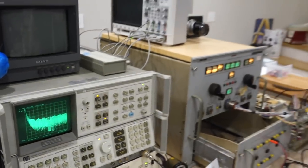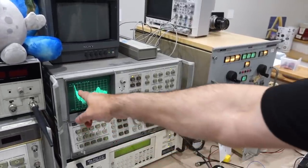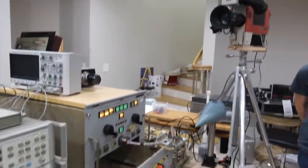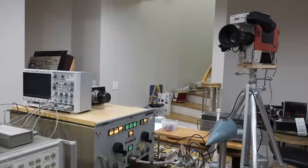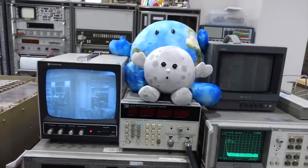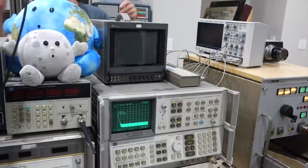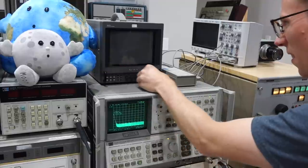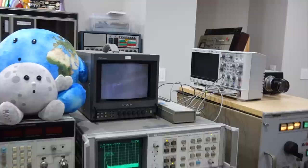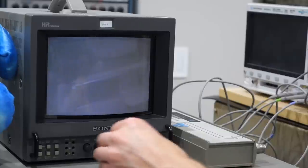Right now, this is the black and white from our camera, and most of the signal is below one megahertz. But with the color camera hooked up, we now have color. In regular NTSC, the color subcarrier is at about 3.58 MHz — so let's hook it up. I don't have any hopes; we'll probably get a black and white picture but won't get any color information. Oh wait, there's a picture! We got a picture — it's on a black and white monitor, so we get the black and white information. Actually, it's a much better picture than with the other Vidicon. We see something... I'm going to turn the brightness up. We see vaguely... a little bit of color. Yeah, there's some color there!